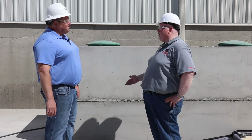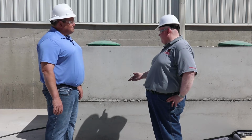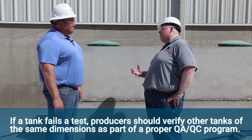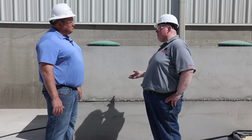Claude, for a leak at the joint, I would recommend a modified polyurethane sealant that's a caulk material. You would apply that to the joint while it's under vacuum and allow that vacuum to pull that sealant into the tank to make a seal.